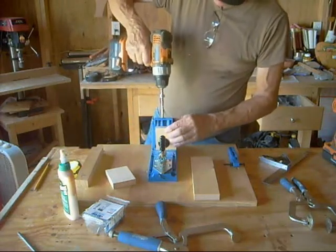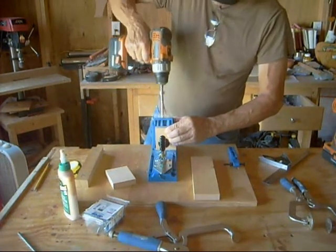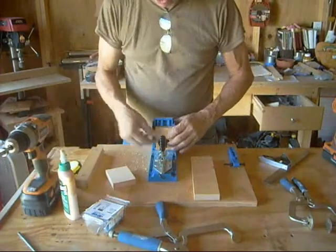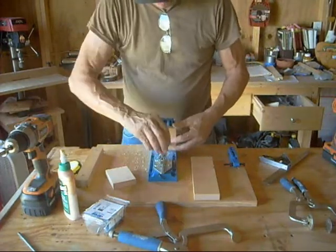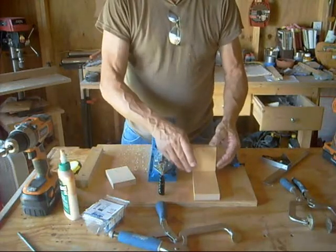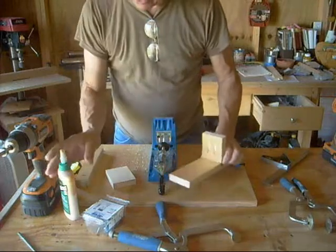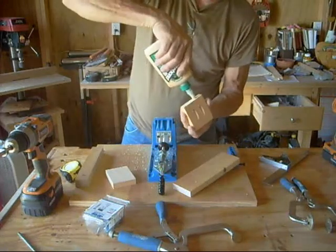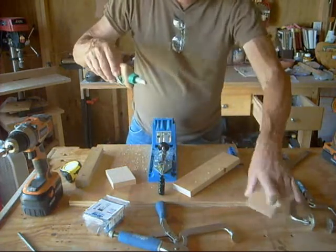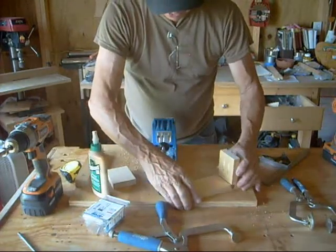Take your bit and make sure the jig is tight to the wood. I'm going to take this and screw this to the base. I'll go this way — I've got a line here. I'm going to take a little glue. We're screwing end grain here, so clean those holes out a little bit. And I'm going to screw this down like this.